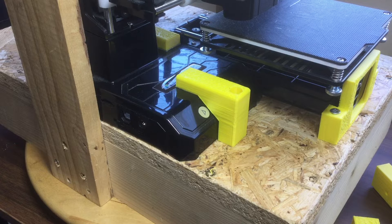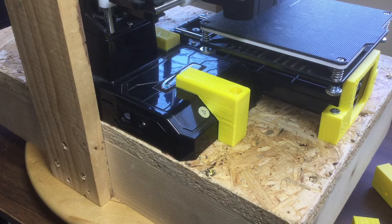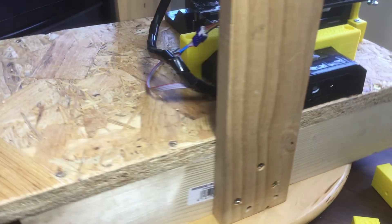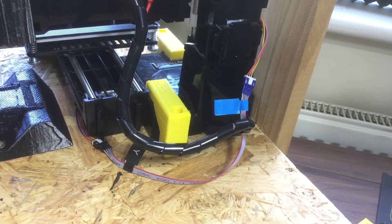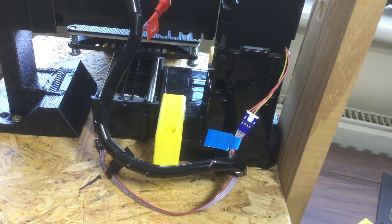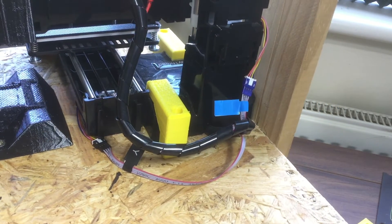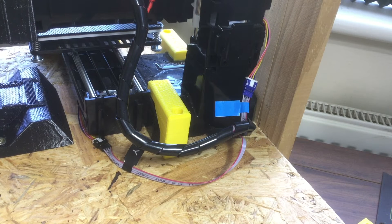These ones are self-evident to hold down the base of the printer. I've done two of those and one is all that's required - it fits the front and the back. It just goes over and holds the base down with one screw. The rear one, we had to avoid the home button, but you can still get access to the home button, it's just over to one side. And it does stop that from moving on the bed completely, so that movement's all gone now.